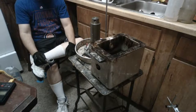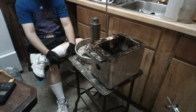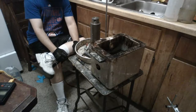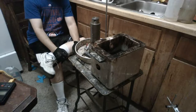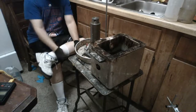With a spiral core, it gives you five minutes maybe of grace period. Five times the window that a smoothbore mold has. And that is why the early molds had a spiral core. It is because it increased the window of opportunity to remove the core. Believe me, I've seen smoothbore cores in, you have to get those things right out.